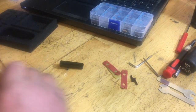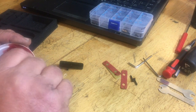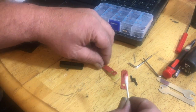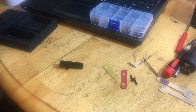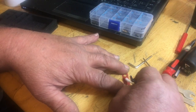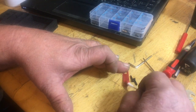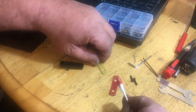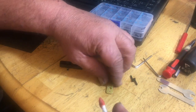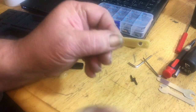Here's a little trick that I use. I know I like the grease, but just basically drop it on the floor like I just did. Now, put a little grease on the gasket there, it helps it seal. And then take your spacer, put that on there like so. Now your gasket's stuck there permanently. You can line it up. It ain't gonna fall off on you.